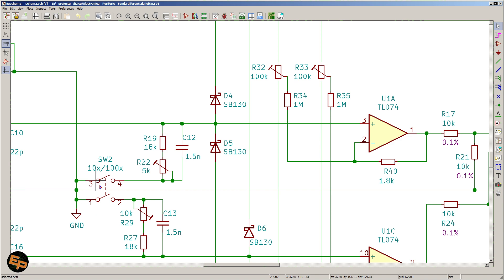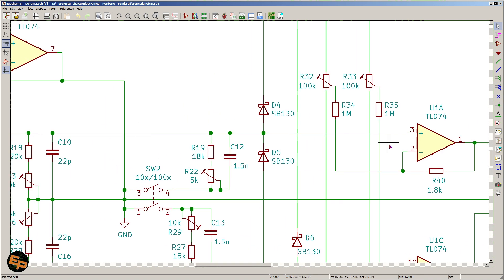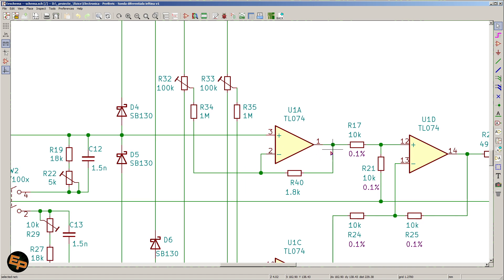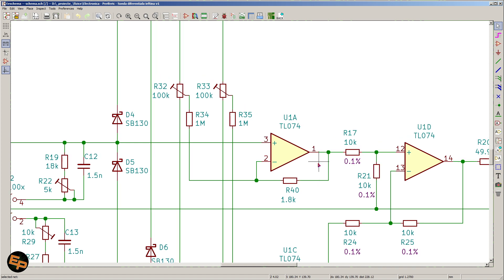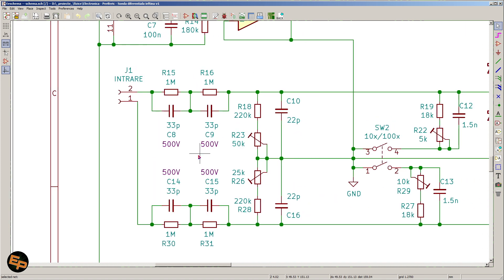This is due to the fact that my 1.5 nanofarad capacitors were actually slightly less than 1.5 nanofarads — I should have placed extra capacitors in parallel to bring them up to 1.5 nF, but I didn't care that much. The difference is about 3 decibels from the lowest frequency up to 1 megahertz, and 3 decibels is not that big of a deal for me, especially for the 1-to-100 ratio which I will very rarely use. This is for the positive half and comparing it to the negative half — going back and forth between them, the differences aren't all that big.